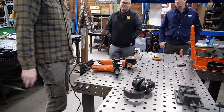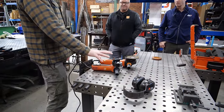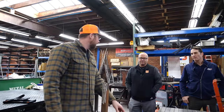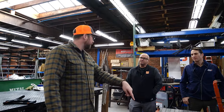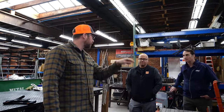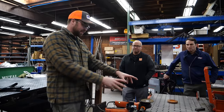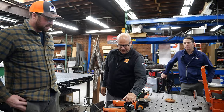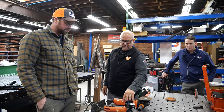No, but this is my chosen starting team, because you have this for the small detail stuff, where maybe you are upside down all day, and a bigger grinder like this is going to get heavy. But when you really need to chew into something, strip paint, strip rust, grind it down, then you switch over. The great thing about this grinder here, the CG15, is it's 100% duty cycle.